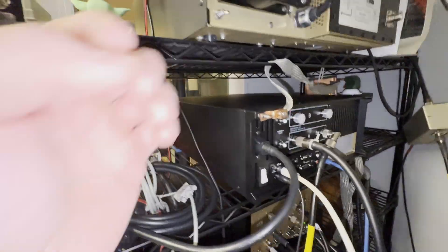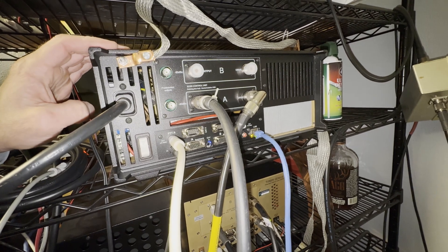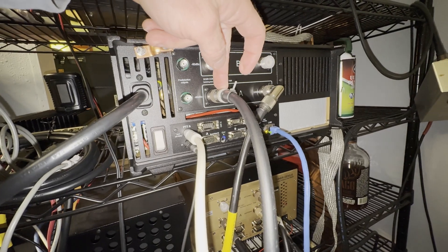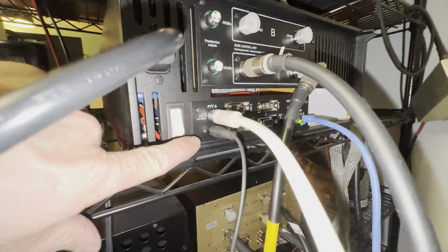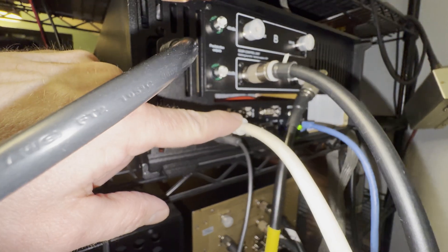Let's go around the back side into the equipment room and check out how it's hooked up. Let's look at the Power Genius and what we've got hooked up here. Nothing but PTT and RF cables hooked up to it right now. So just the RF in from the 5000, RF out, coax down to the Tuner Genius. Then I have a PTT in over here, then a PTT out that goes to the Tuner Genius — so PTT from the 5000 out to the Tuner Genius.